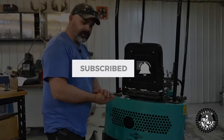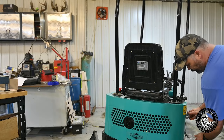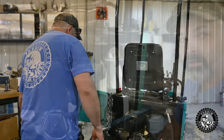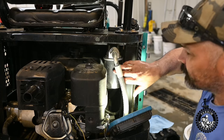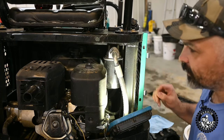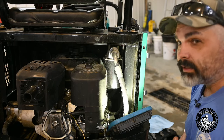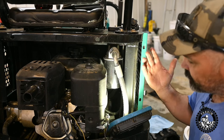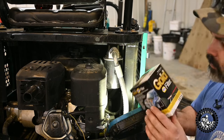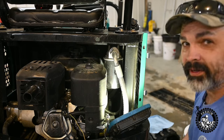Now while that's draining, we're just going to open up the back of the QH-12. This is a modification I did shortly after I got it. The nice thing with these QH-12s is they actually have a hydraulic filter system, which is a great thing. It's too bad it doesn't have a hydraulic cooler — that might be a modification I do at some point. We're going to take that out and hopefully this Napa 1515 is the right filter. We'll find out real quick.